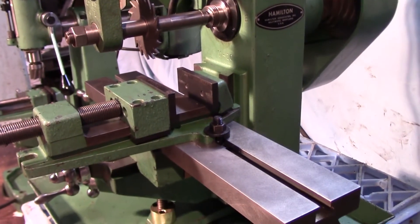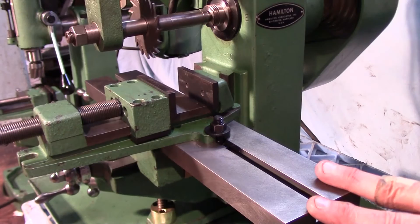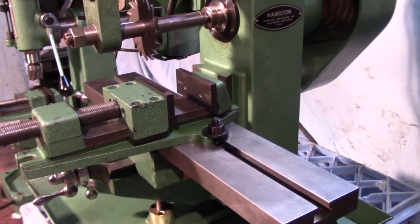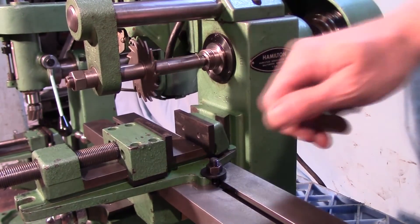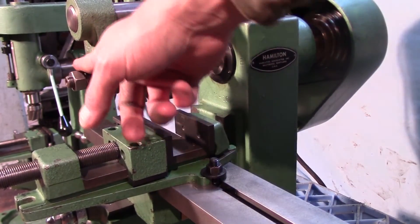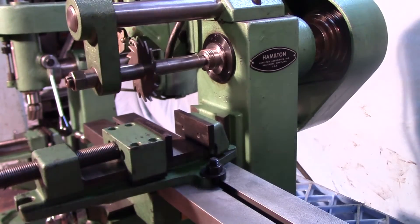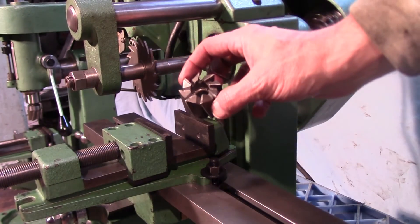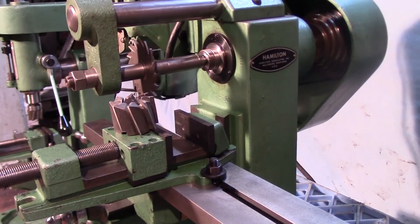The table itself is in great condition — there are just one or two little nicks on it and you can still see the original milling marks from manufacture. Both mills have the original vices with them, which is nice since those tend to get lost over the years. This one also had the arbor along with quite a few original spacers with the keyway cut in them for mounting and spacing cutters. When I got it, it had fairly large inch-and-a-half Brown & Sharpe cutters mounted on it, which for metalworking is probably a bit oversized, though fine for woodwork.